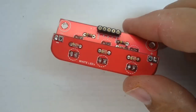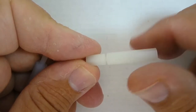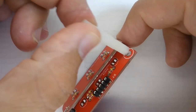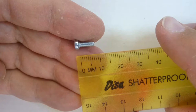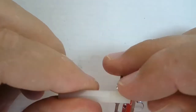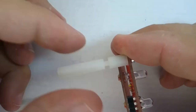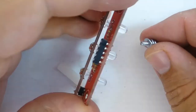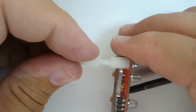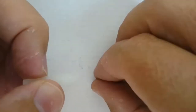Once the module is complete, locate the M3 spacers — two long and two short plastic spacers. Mount a short spacer on each long spacer. Find the M3 cheese head screws that are about eight millimeters long. Note these screws may be too long because the hole is partially blocked by the screw thread on the longer plastic spacer. Placing a spring lock washer and flat washer underneath the screw head will partially solve the problem, and you can fill the remaining gap between spacers with a spring lock washer or two flat washers.